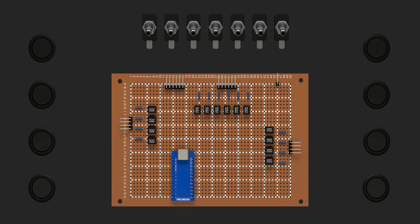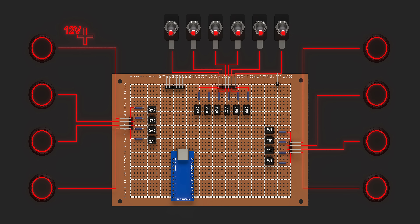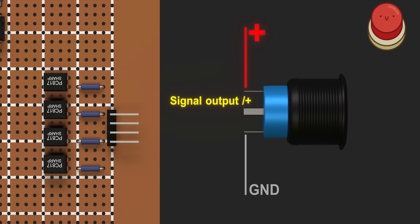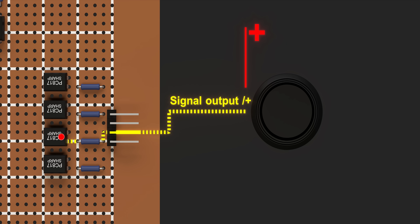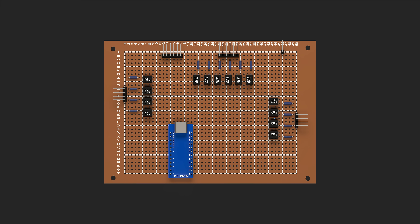To make the wiring functional, I connected the ground from the power source directly to pin 2 of all optocouplers. Then, for each button, I only used one wire as the signal line, which carries the positive 12V. This wire comes directly from the button and is connected to pin 1 of its corresponding optocoupler. Now I can turn the LED on or off without affecting the signal going to the optocoupler, because the positive line is always present, and the switch only cuts the ground connection to the LED. The internal LED inside the PC817 turns on, triggering the output side and signaling to the Arduino Pro Micro that the button was pressed.